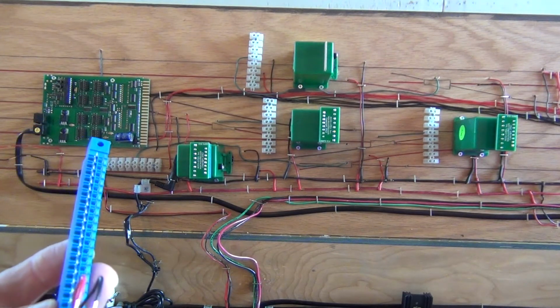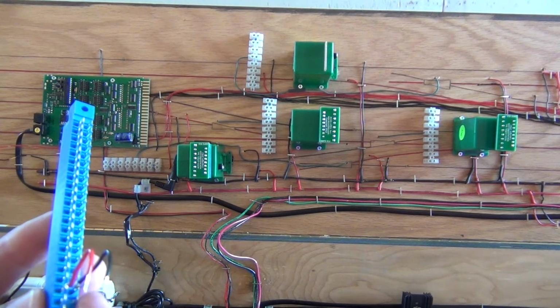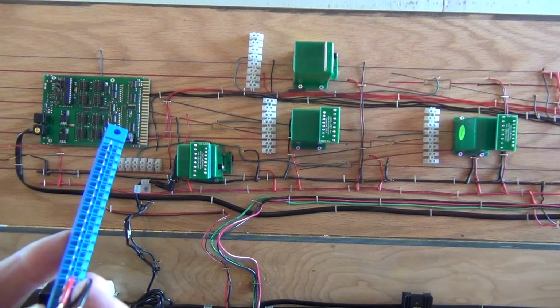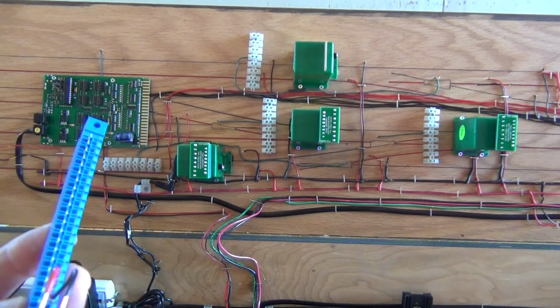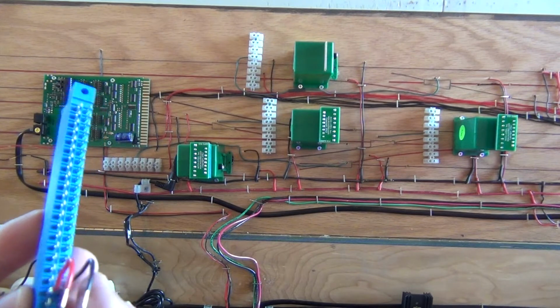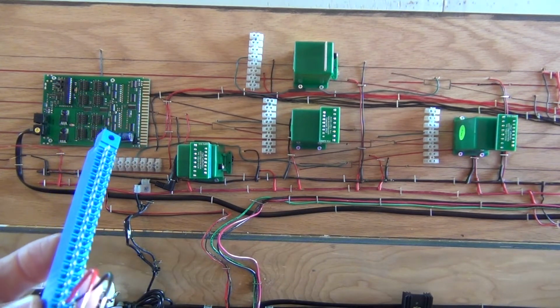Now this will control 8 slow motion switch machines, and they're going to be the alphabet portion, or the lower half. DE is going to control Tortoise 1, FG is going to control Tortoise 2, and so on and so forth. You can control up to 8. So I'm going to wire black and red alternating wires off these bottom ports, and we're going to run them to the Tortoise switch machine.